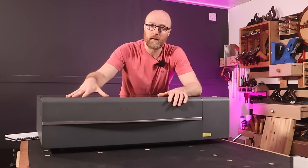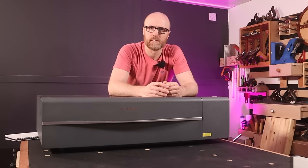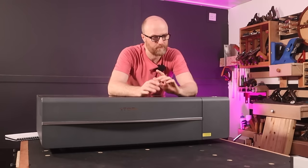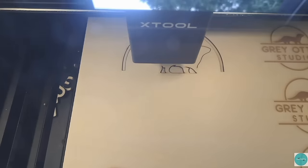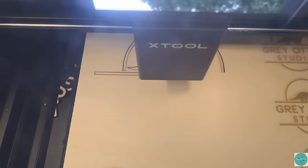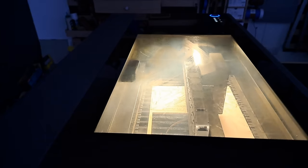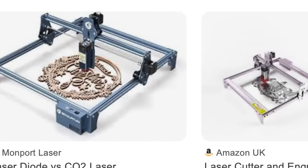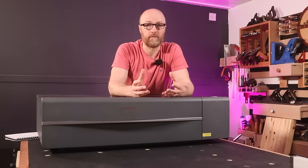Take away the fact that this is more powerful, faster, has a larger bed and all of the extra accessories compared to some of the smaller diode lasers — there is still the safety concern, and this, to me, is top. It's the main consideration of why you'd go for something that is enclosed like this, as opposed to an open laser. This is burning — that's what it's doing, it's how it cuts. And what it's cutting, probably 90% of what people are using it for, is a form of plywood. Plywood is made up of sheets of wood with glue and a lot of chemicals within it — things like formaldehyde. What you're creating when you cut all this plywood is quite a lot of smoke and fumes. If you look at most of the cheaper diode lasers, they don't have anywhere for that to go but straight up into your workspace. Unless you're using them outside, you're basically breathing in everything that you're cutting, and that doesn't strike me as something that's very safe and good for your health.